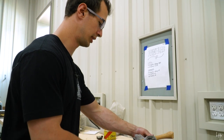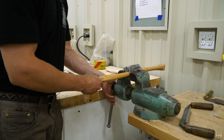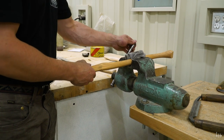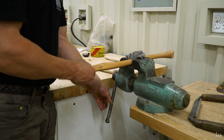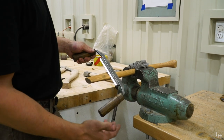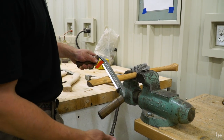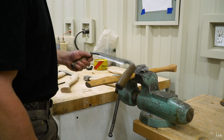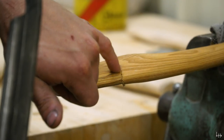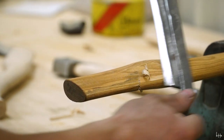After the first hammering on the handle, we need to put it in a vise. These handles come with a nice finish on them, so we want to try to protect that finish—it means less work for you in the end. A lot of store-bought axe handles come either way too thick, lumpy, or with varnish on them and you have to do work to them. We put a rag in there to protect the handle and clamp it down. There are a variety of tools you can use to remove the material on the eye. I use a draw knife, but you can also use a rasp, a spokeshave, your pocket knife to whittle, or even another axe. All we're going for here is to remove the material where we see compression and rubbing, and taper the wood back.